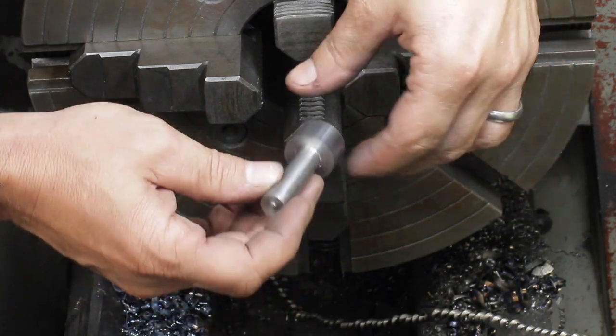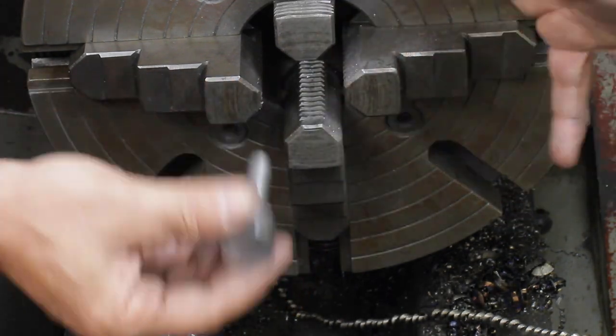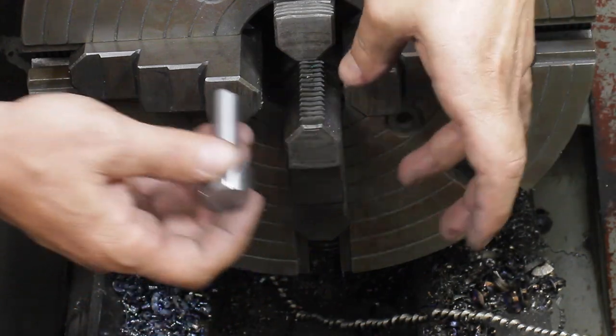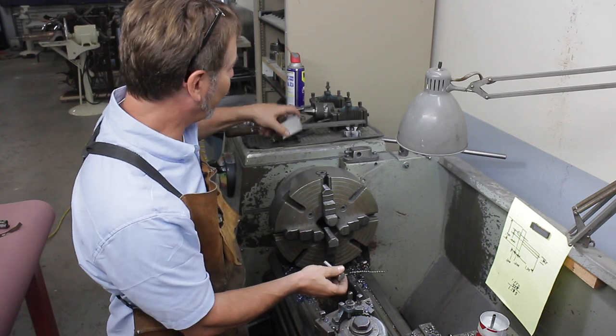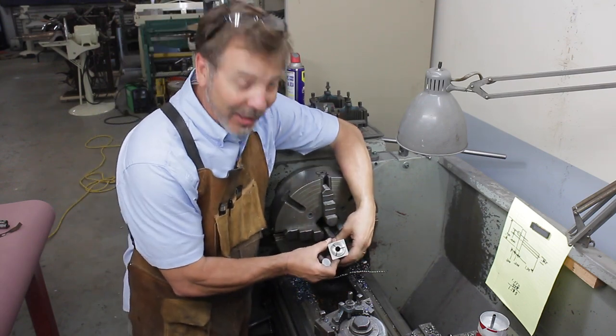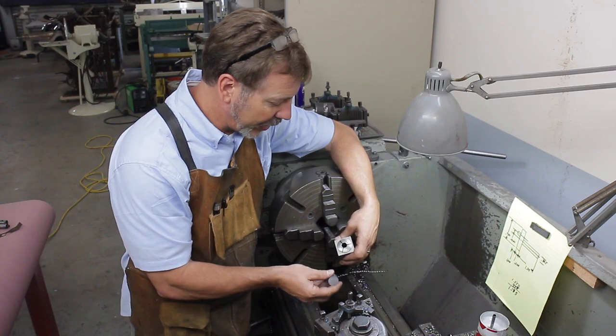So I took the material out, cut it off, and now we need to put it in here. Well, we've got some challenges. For one thing, these jaws, when tightened in, will not clamp around a 1/2 inch. So what we're going to do is take a collet block. If you haven't seen a collet block yet, I've got a video on that, and I'll put a link in the description.